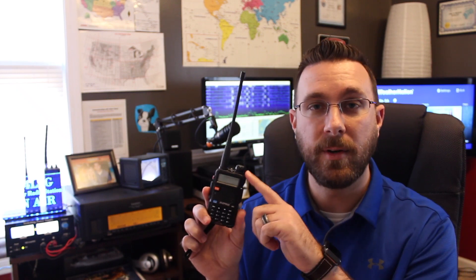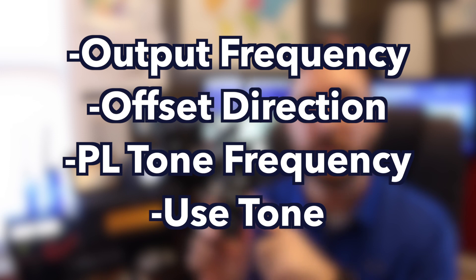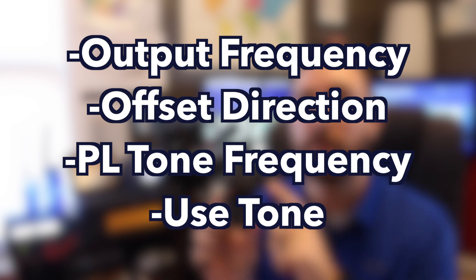Until you feel more comfortable, I'd recommend making a few contacts through a repeater before you try simplex. When you find the information for a repeater, you're going to have a couple different pieces of information. Most often you're going to see a frequency for the repeater, which is known as the repeater output frequency. The way the repeater works, you transmit on an input frequency and it simultaneously transmits on an output frequency. The split between the input and output frequencies are pretty standard, so most often you'll just see the direction of the split as plus or minus offset. You may also have a piece of information called the PL tone, which is a sub-audible tone that some repeaters require before activating. PL tones help cut down on interference, and they're very common on analog repeaters these days. Once you've got the information for a repeater that's within range, you'll need to put it all in your radio — program in the output frequency, the offset direction, and if there's a PL tone, put that in and instruct the radio to use PL tone. Then save that configuration into the memory of your radio.